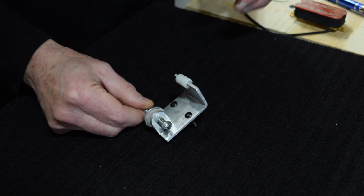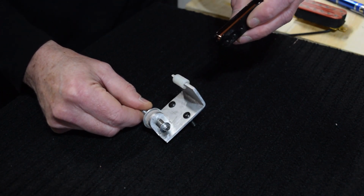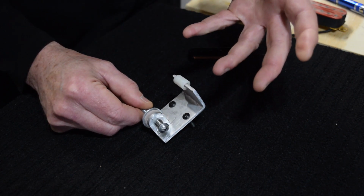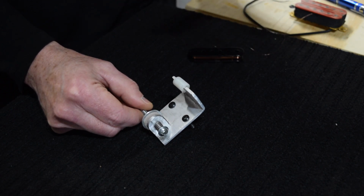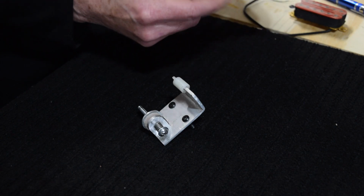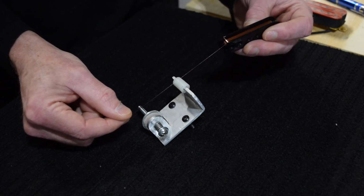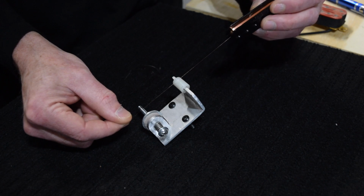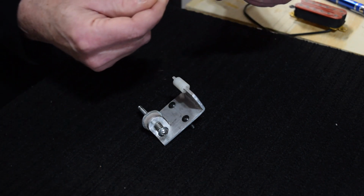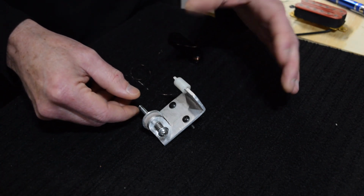However, since the bobbins I'm winding are oblong in shape, and because that causes the tension to vary during the course of winding, I don't really think it's going to be that accurate. What I would have to do is measure the tension at different positions of the bobbin as it's winding, which I'm not sure is even possible to do. I'm sure there's a way to do it, but then I would have to average that to get the number I need to modify my formula.